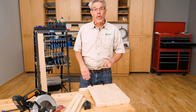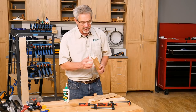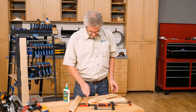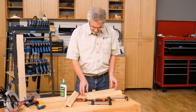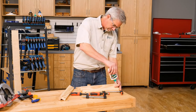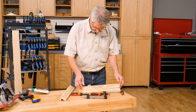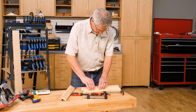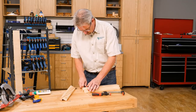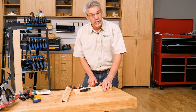These are for the legs. I've got a whole bunch of dimension lumber to cut so I better get busy. For this entry bench we glued up the one by two components into an L-shaped leg, and you'll find out how handy that is later on. In order to do that, I'm going to use this dimension lumber to hold the pieces properly aligned. All you need to do is run a little glue — any kind of wood glue will do — rub it together, spread out the glue a little bit, then clamp the leg into an L. The glue needs to cure for at least an hour.